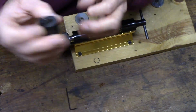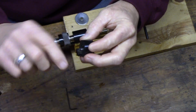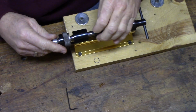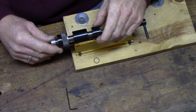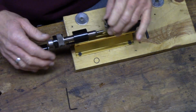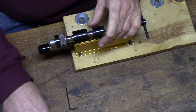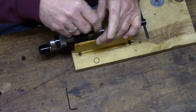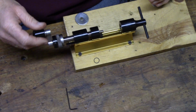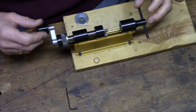The cutting head itself, you can see right here. There's a carbide cutting head right there. Never wear that out. I can't imagine it. That can go on. Remember, this shaft still has your cutting edges for trimming length, so you want to set your depth plenty out so you do not engage them. We don't want to shorten up our brass, we just want to turn the neck.